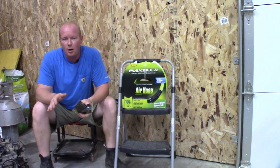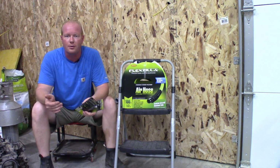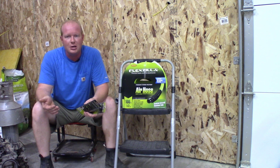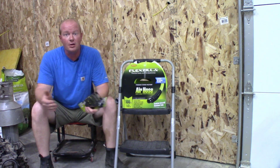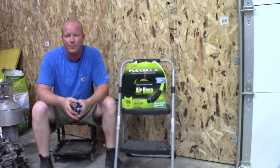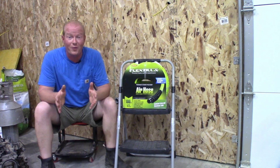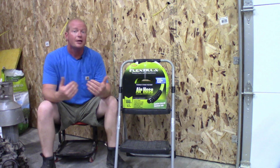And I didn't want to go with something that was going to rust, like a galvanized tube buried underground, because I'm always going to be creating condensation that way with the heating and cooling of the ground and the air pressure and moisture moving through that. Even though I have a dryer on this, I know I'm always going to have moisture just because of temperature changes. I decided to go with the guys at Flexzilla because of the extreme temperatures that this hose can endure.